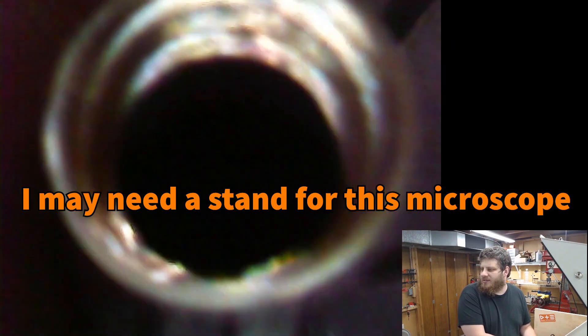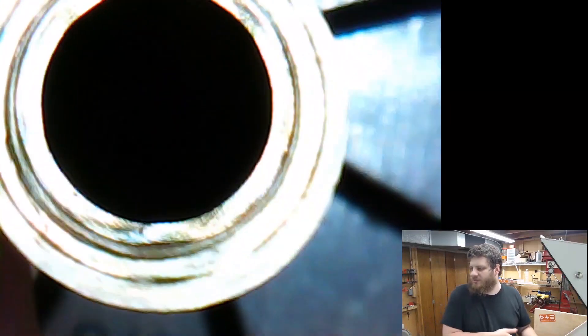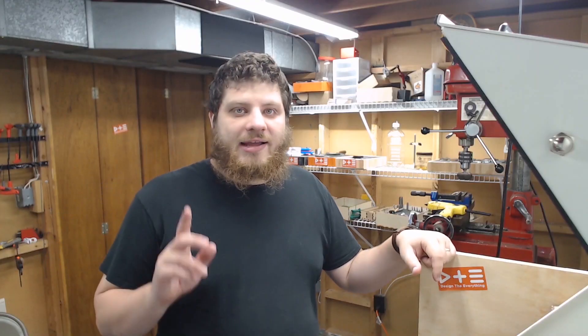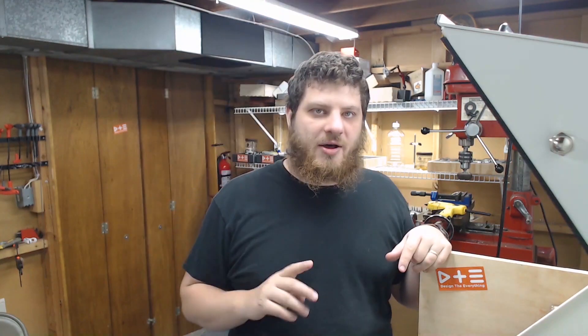On the good news side, when I reran this it's more centered — less runout on this one. Don't know why, probably just got lucky with how I mounted the collet this time. Let's rerun it and thread higher up — double-blind threads, who knew. Same thing except this time it's going to thread well above the top of the hole.